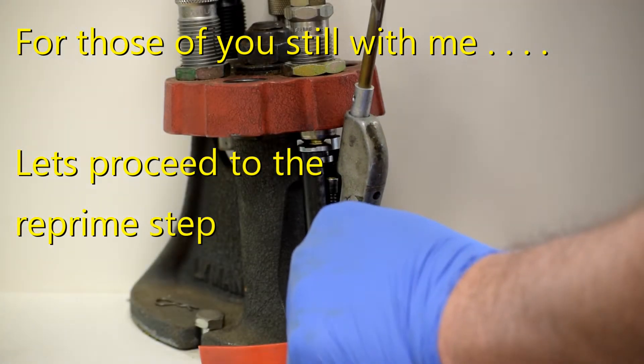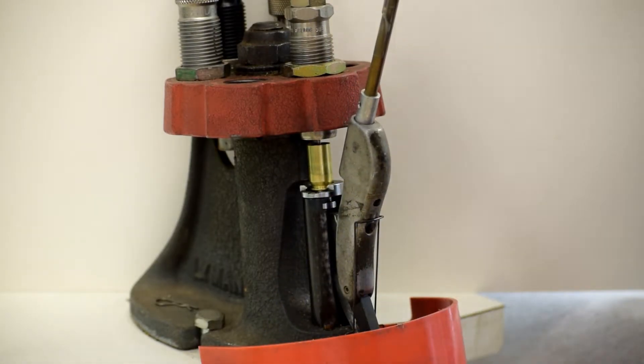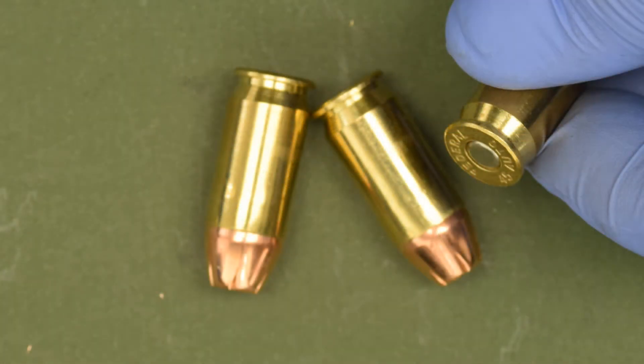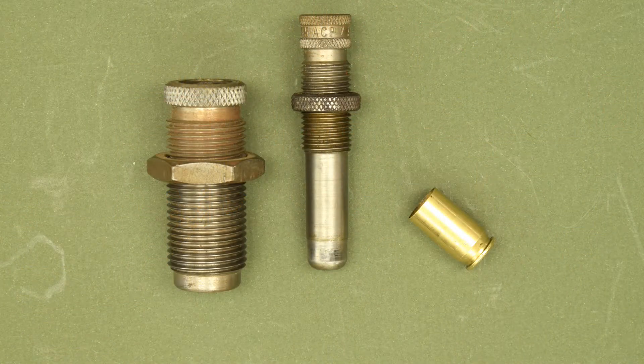Push this holder arm in and carefully bring the cartridge case back down into that ram. Seating the primer must be done very, very carefully. Think back to that picture of that protruding anvil. We are doing more than simply seating the primer in the pocket — we are actually sensitizing it. When the primer is correctly seated, it rests just the slightest amount below the cartridge base, and you can feel that it is in deep enough easily with your finger, which is generally more accurate than trying to measure its depth with a caliper.